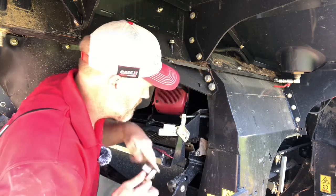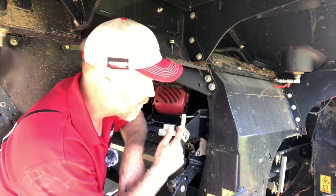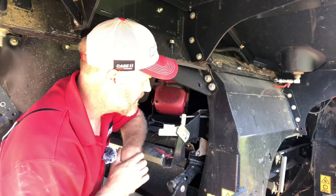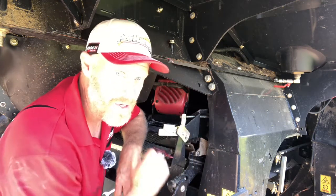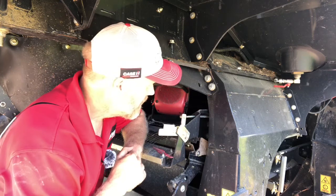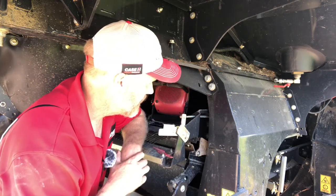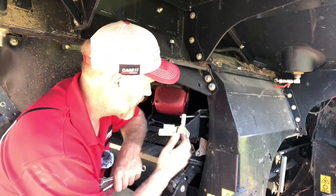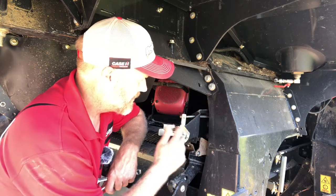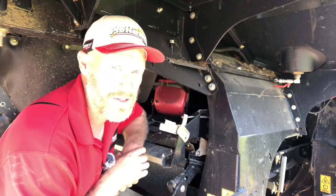And once again, if you're using the 1-5/8 closed slat, you're going to adjust it with it in the fourth notch to that 10mm. The important thing as you make that adjustment — loosen it off, push it all the way forward, slide it back. Just like the calibration on the other sieves, you want to open it up to that setting for your calibration. Check it with your sieve gauge and lock it back down. So now those numbers mean something to me. I'm at 6mm here with this one for corn, and I'll typically close down one or two notches when I do soybeans.